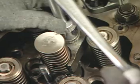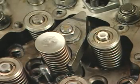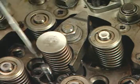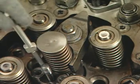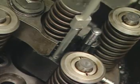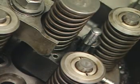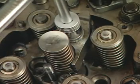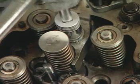On engines equipped with mechanical unit injectors (MUI), check to ensure that the injector crab is not cocked at an angle that would prevent the use of the injector timing gauge, EMD part number 8034638. Torque the injector crab nuts on either the MUI or EUI to 50 foot-pounds or 68 newton meters.